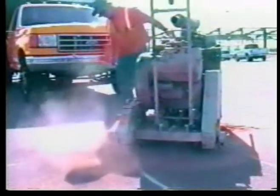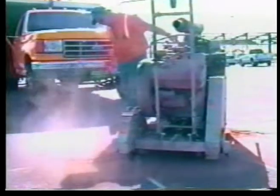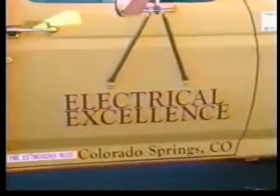If you are wet cutting, make sure there is no standing water in the slot. Slots that are slightly damp or moist are recommended to ensure desired penetration and adhesion of TA-500 in the slot. Standing water will create voids in the sealant.